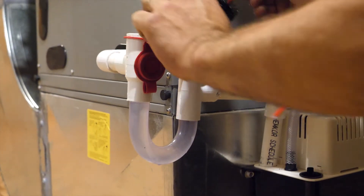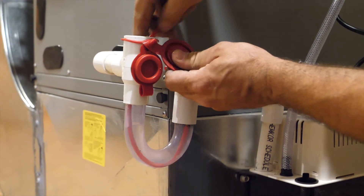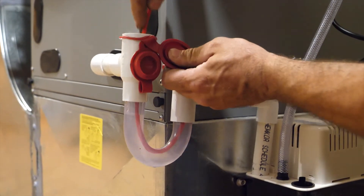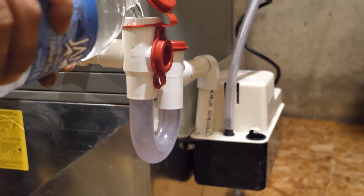To do this, you will need a few liters of hot water and the flexible cleaning brush supplied with your pump. Start by taking the cover off of the p-trap and use the flexible brush to clean the debris from the inside of the p-trap. Next, wash away that dirty water by pouring in a few liters of hot water.